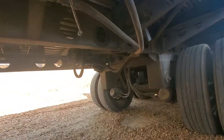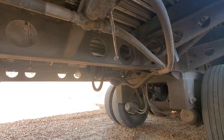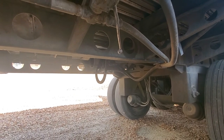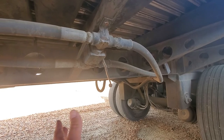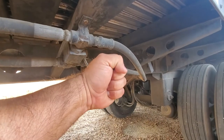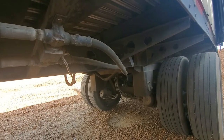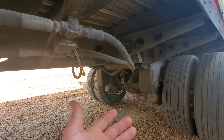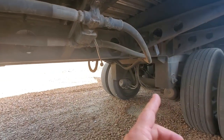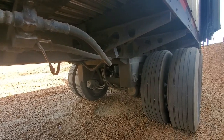The operation controls — you have three pistons that draw the floor in. I think there's eight slats on each piston, so eight come back, sixteen, twenty-four, then when all back, the floor moves to the rear as one, dumping it out. This engages it. This little handle right here will reverse the operation so I can draw pallets on, or move my load. Once loaded, if I'm too heavy on the front and not heavy enough on the back, I can walk it back and forth until I'm perfectly legal. Really easy to get this trailer to 80,000 pounds.